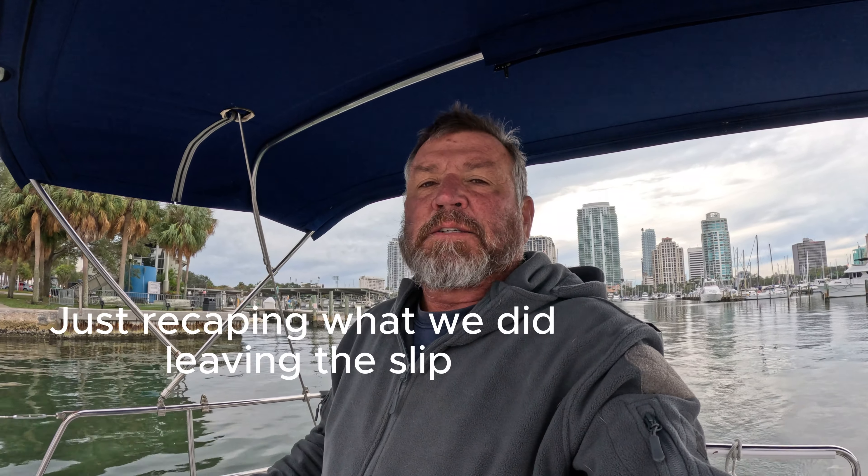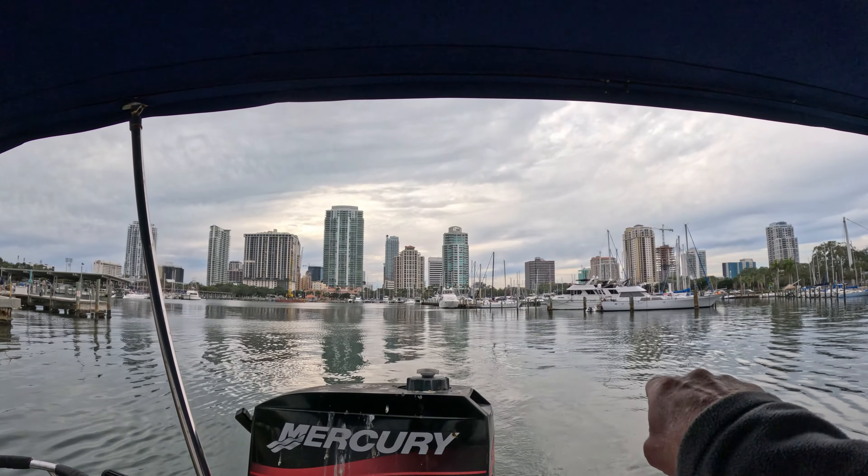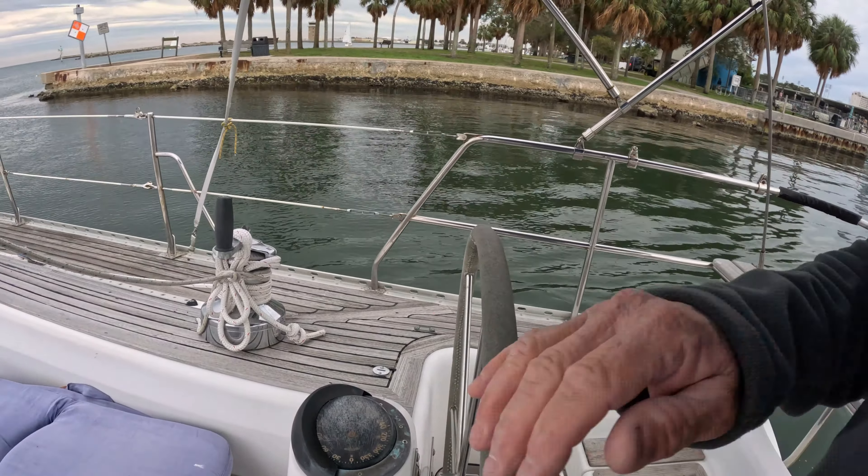Until we got enough speed, then we turned around and steered that way. You take your helm and turn it in the direction you want to go backwards. Then we put it in neutral to see if the engine would stall. We coasted backwards until we cleared all hazards — the dock, telephone poles, whatever it might be. Once we cleared those, it was time to move the steering wheel fully in the opposite direction. This is how you turn a sailboat — it's called prop walk. Turn that helm all the way to the opposite direction, put it in forward, and the bow will naturally spin around for you.